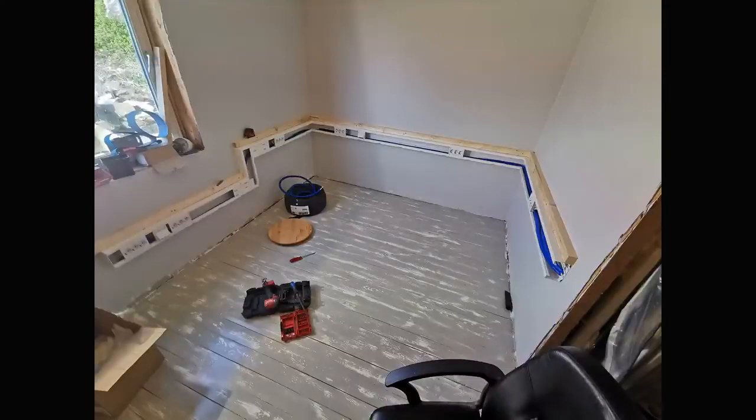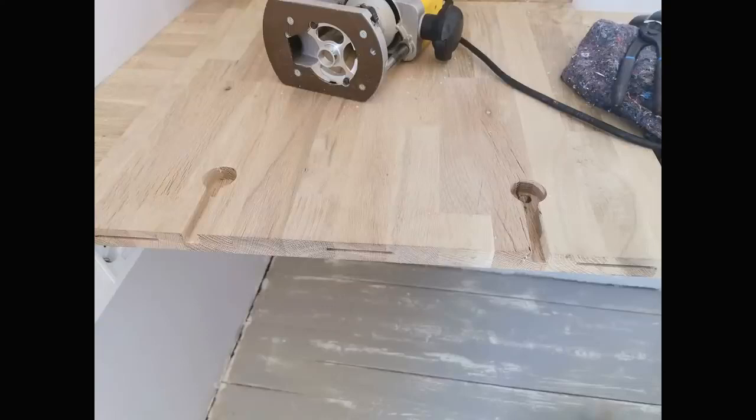Now, he's been very good building these benches. He's made them out of laminated timbers, and it's oak, and he's treated it with Osmo. But let's have a look at the process. These things I always knew as towel rail bolts. So basically there's a recess that he's created for a bolt to be tightened up under the bench.